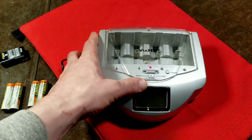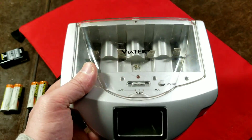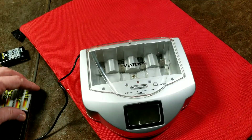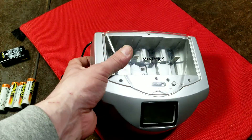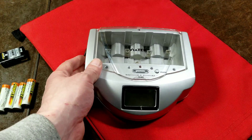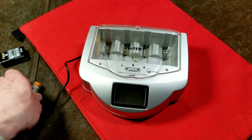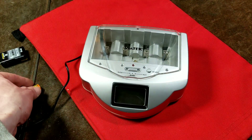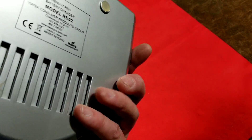So this was just my little review of this Viatec. It really is a gimmick to recharge alkaline batteries — you do get a little bit of energy back into them, but it's nothing like a nickel metal hydride where you get full recharges hundreds, if not over a thousand times. And getting one to use as a regular battery charger, it doesn't work very well either. It's also very weak and slow, even in nickel metal hydride mode — it takes a couple to three hours just for double A's. If you have large capacity D cell batteries, this thing could probably take all night. So that was the gist of this Viatec REO2.